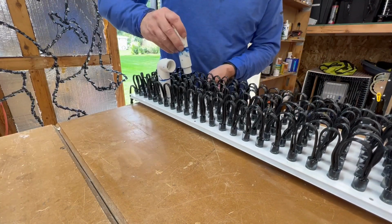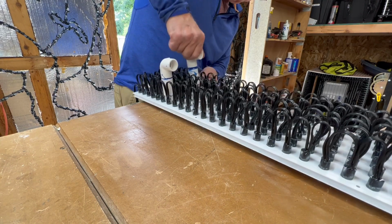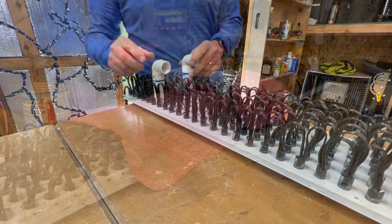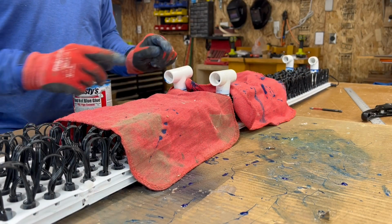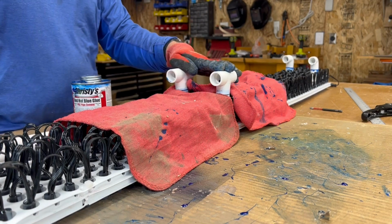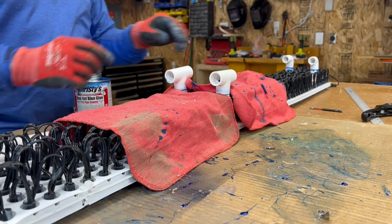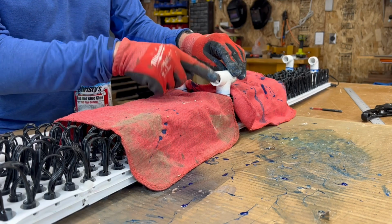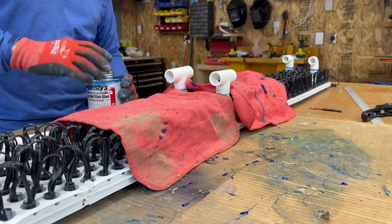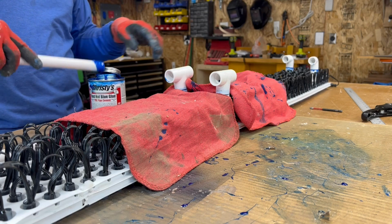And here's the second one, doing the same thing. And that'll give me a nice solid support. Have it loose right now. Alright, so I've cut some PVC pipe, two sections to go between two adjacent T's. I cut it to length to make sure, because each T is a little bit different on the length from the edge into the seating point. So you want to measure that to make sure that you have good contact, that you get the right length.